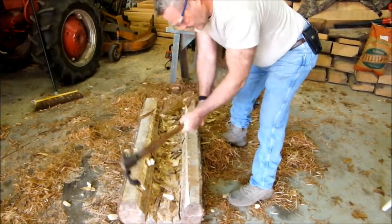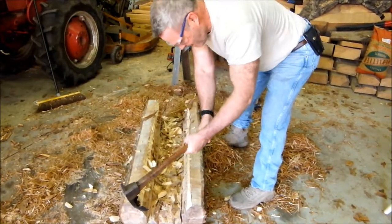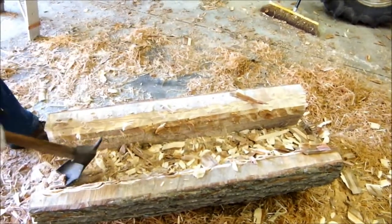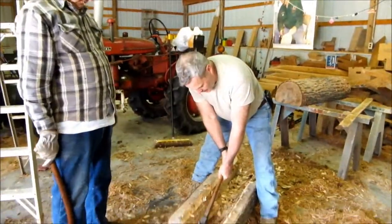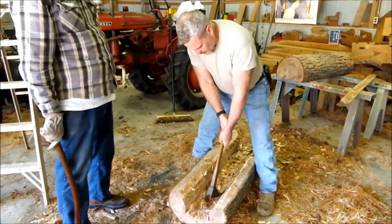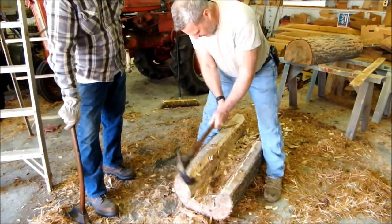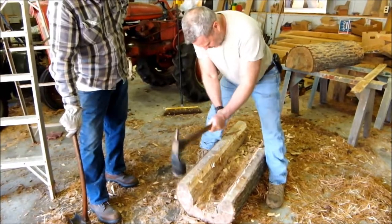About now, isn't it? Yeah. You don't really want to hit it like that, like a beaver's chopping at it with its teeth. You want to be more so that the bit of the adze, the blade of the adze, is more parallel to your surface. Okay. So when I hit like this, even though I'm going through sometimes, you're shaving. I'm shaving it.